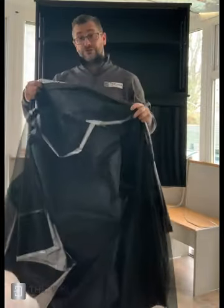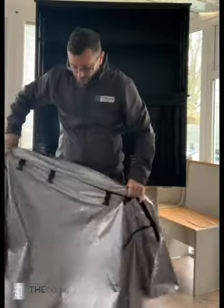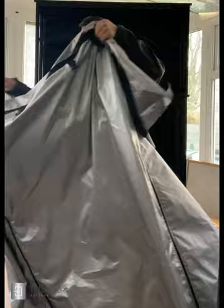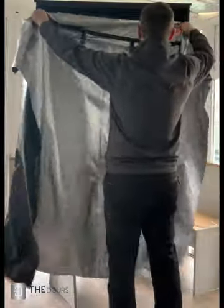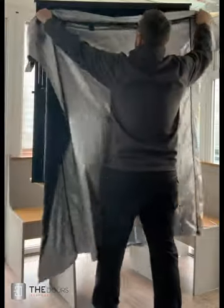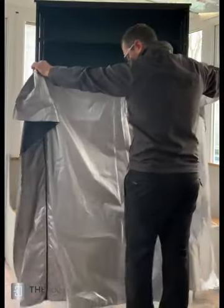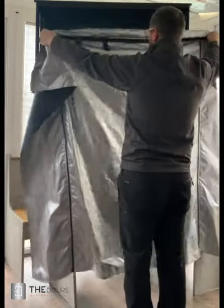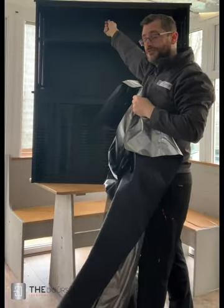So the front of the door is black, and that would go above your opening. What you do is you measure up and align your opening. Once you're happy with the height and the measurement to the floor, so you want it touching the floor, just above, then you clamp the centre into place.